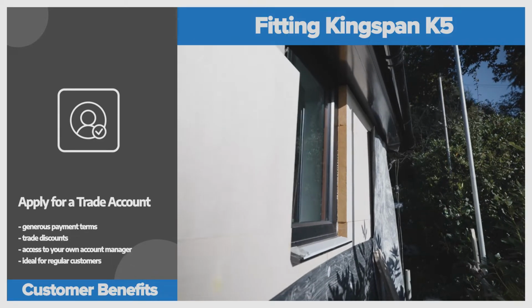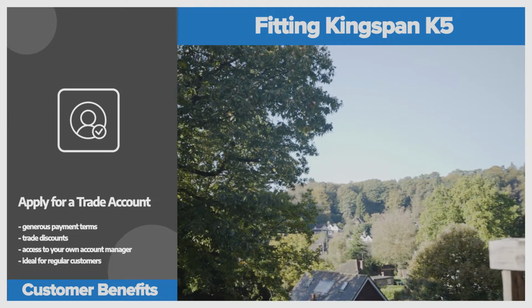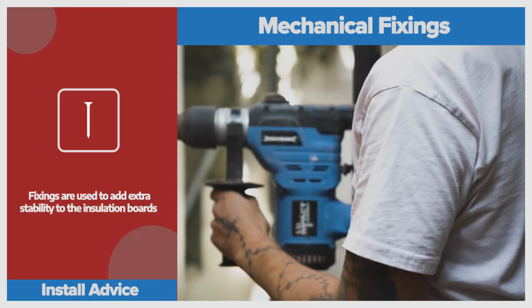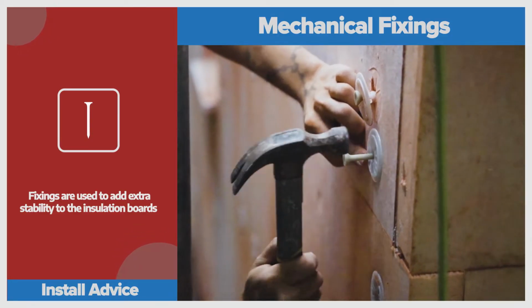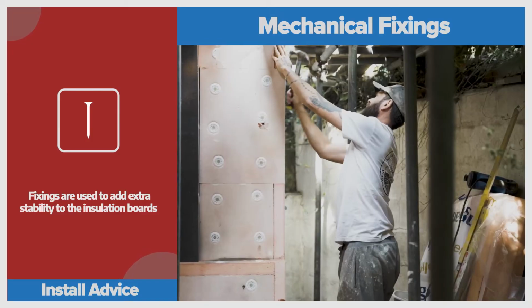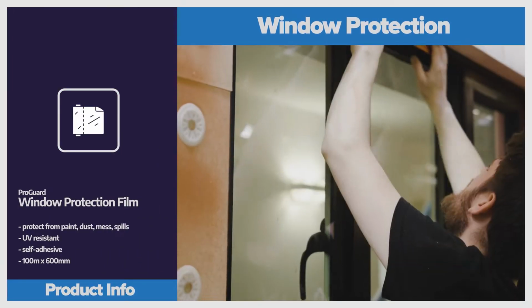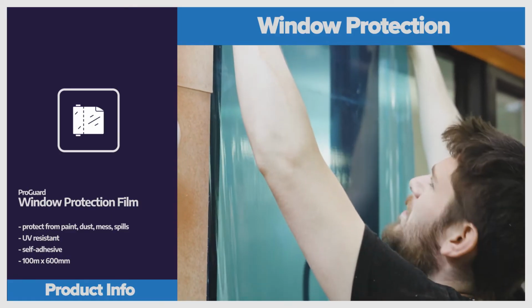Once the adhesive had dried, it was important to get the mechanical fixings in place. These were pre-drilled through the brick substrate and hammered into place. This is repeated in various places across the board and in accordance with the fixing pattern provided. This was also a great time to protect the windows with ProGuard window film, which we sell in 100-meter rolls.